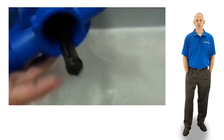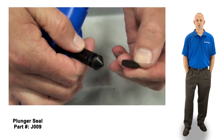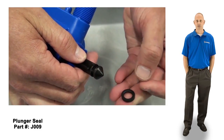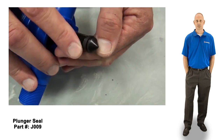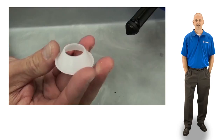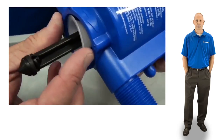Pick up the blue unit and remove the plunger seal by pinching and rolling it off the plunger. Install the new seal into the groove on the plunger. If the white plastic retainer slides down, just reposition it with the slender part up into the body.